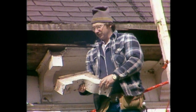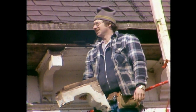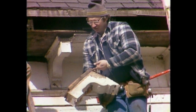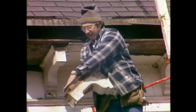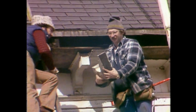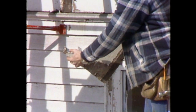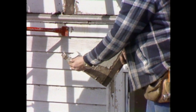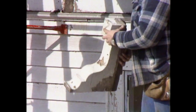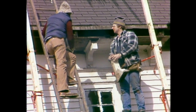A mill could make these up, but it would probably cost about $35 to $40 a piece, and we must have 40 or 50 of them — so that's out. Can we repair them? We thought possibly we could cut this off here, which would remove most of the rotten wood, and then laminate another piece back on. That would save the top. But we're also running into a problem at the end — these break off when they're installed. So we thought of cutting them off here, putting them on the house without that piece, and with a little bit of trim instead of spending $40 a piece, we'd still retain the look of it.